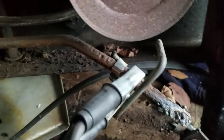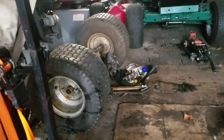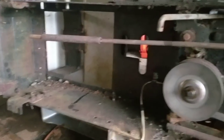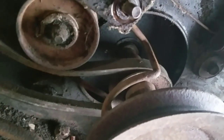As I weld these together, sometimes this drag link touches the big mower deck crankshaft pulley. If the transmission and pulley system I have swapped out works — I'm waiting for a 52-inch belt that goes from the rear transmission pulley to the center idling pulley. It's a double stack; the upper one goes straight to the drive shaft.